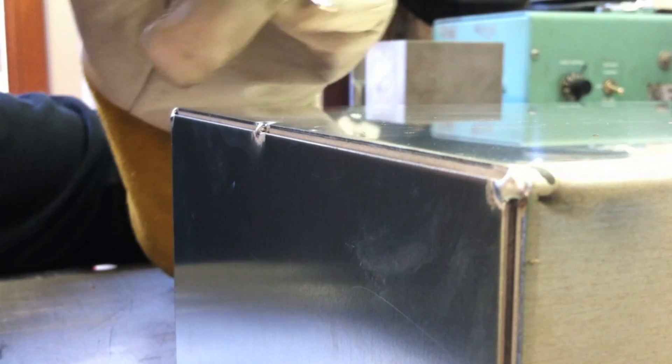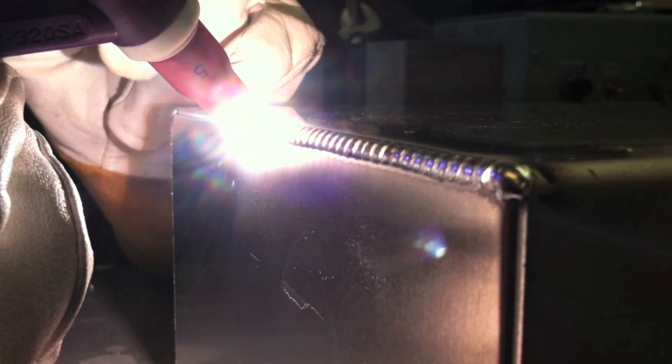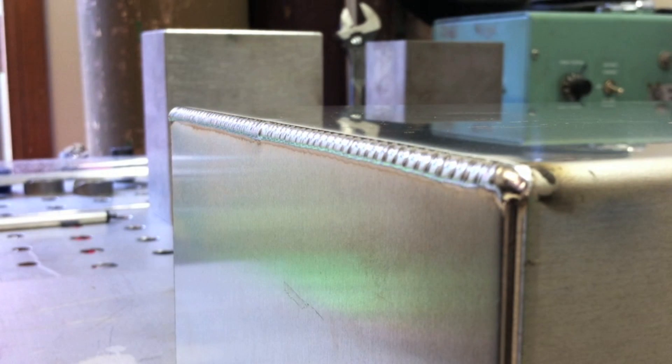Pay attention to what's coming up: there's a tack on the very corner, and if it's under a lot of stress when I light up and melt it, it's going to pop loose and create a gap. So I put a tack about a half inch inboard and then come back up to that corner tack — that keeps it from happening. I'm filming with the pyrex cup; Roy is using a standard alumina cup. We're both trying to dip about once per second and coming out with a very similar weld appearance, even though he's on an inverter at 120 Hz and I'm on a transformer at 60 Hz.